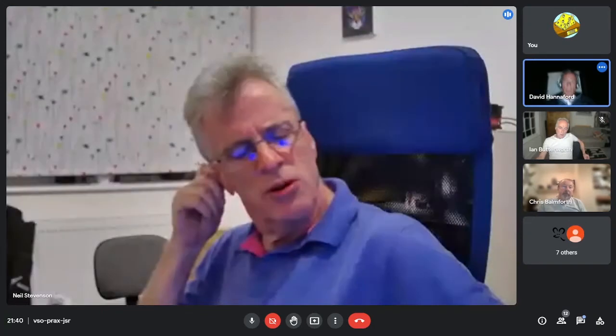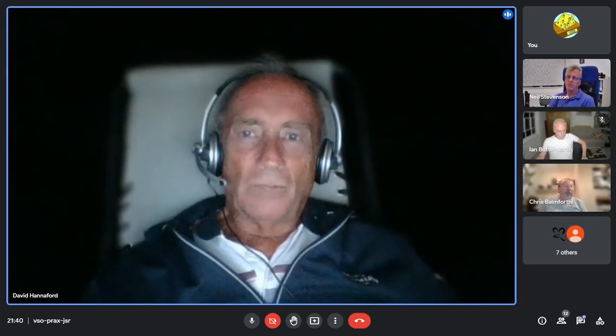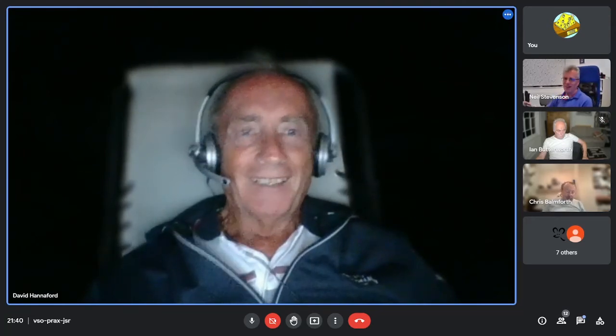There was one question I had. Obviously, I've just built it, so it's fresh in my mind. I wondered why the connectors to the sensor boards weren't aligned above each other, so that you could literally plug the board directly into the main board. It mainly comes down to the constraints on the size of the board that we can do with the free version of Eagle. We couldn't get the row of connectors far enough forwards to do that. So most of us ended up with a strip of Veroboard in between.